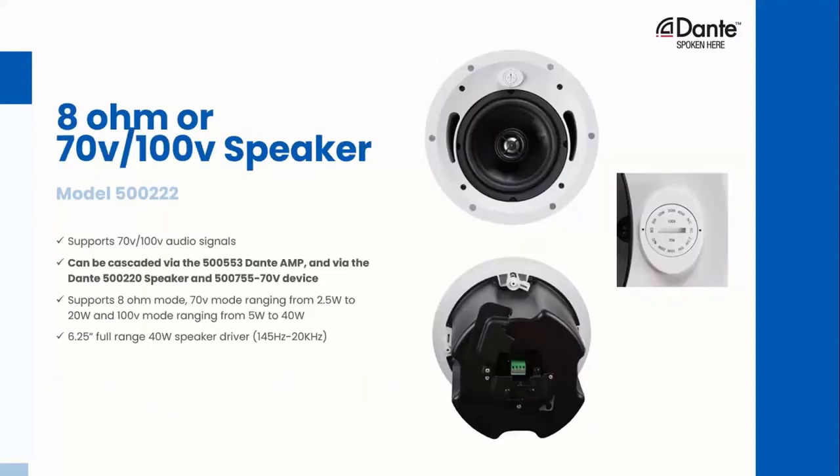We have a passive speaker. It's not specifically a Dante product, but it works with our Dante line. This particular speaker supports both 8-ohm mode as well as a 70/100 volt speaker mode, which means in the 70/100 volt speaker mode you can daisy chain these speakers from a 70/100 volt amp, for example. We're going to be talking about our Dante amp in just a moment, and that particular amp has both an 8-ohm output as well as a 70/100 volt speaker output. So this speaker can be used in conjunction with that Dante amplifier.